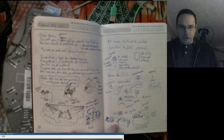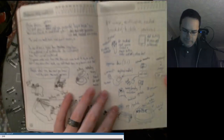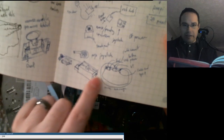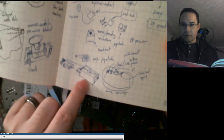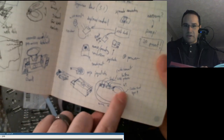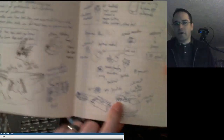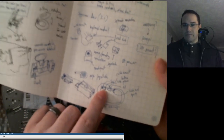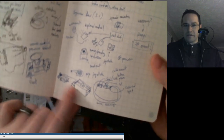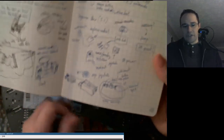This actually is the Bluetooth module. That was something I was thinking about for the Signum Dev. It would have USB sitting on top of it in this little corner here, and then you would have the option of sliding in this USB Bluetooth adapter, and the cable would be set such that it came out the top, wrapped around in cable channels, and then fit into this USB slot again in the corner, so that it would be, you know, captive cable. But if you wanted to put it in the USB feature, you would unplug it from there, plug in this USB adapter from Handheld Science, and then plug right into the back of this, and you have Bluetooth with your wires in the wired channels.